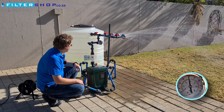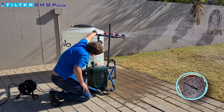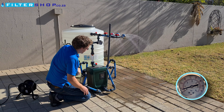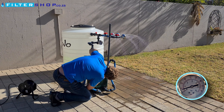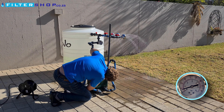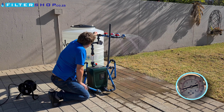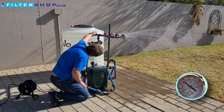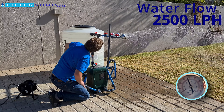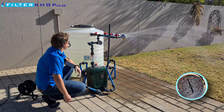It really is incredibly quiet. If we open it up fully, we easily go off the scale on flow rate — over 2,500 liters an hour. It's dropped to 1.1 bar and drawing 900 watts, but we're off the scale flow-rate-wise. At two and a half thousand liters per hour we're at 2.5 bar, which is still very respectable.